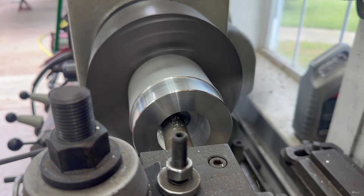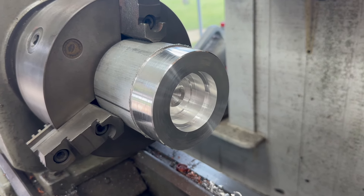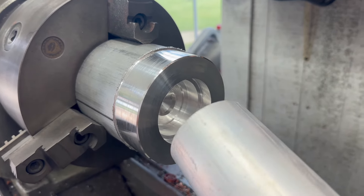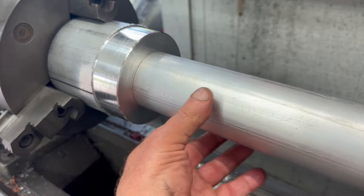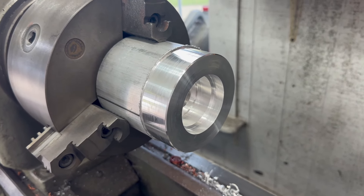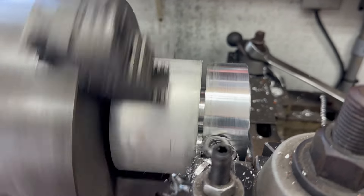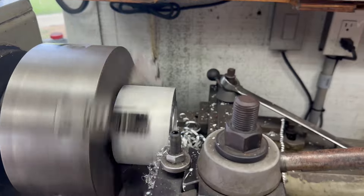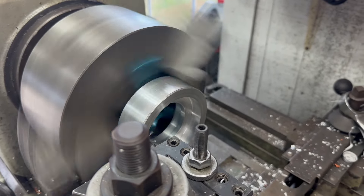Time to make a seal driver. I didn't have a piece of tubing long enough and big enough diameter, so I'm going to make it a two-piece. That's going to be the driver portion, and then to make it longer to fit the long axle, I'll put that in there and weld it. Then I'll pull it out of the lathe and turn the other side to fit the seal. Now parting with the tool — it's going to be coming off here in a minute. There it goes. Got it. Final cut, just finished the final cut.